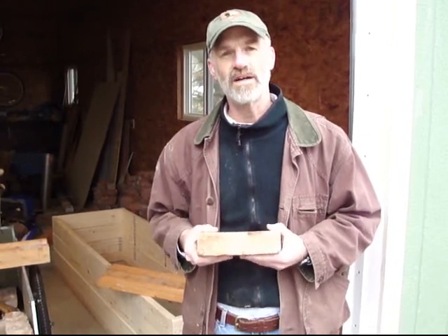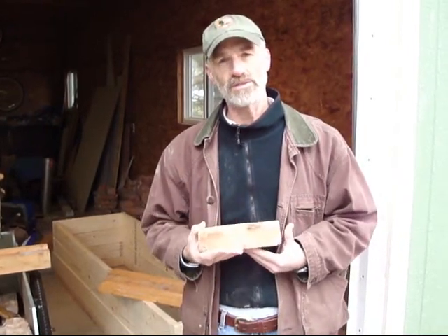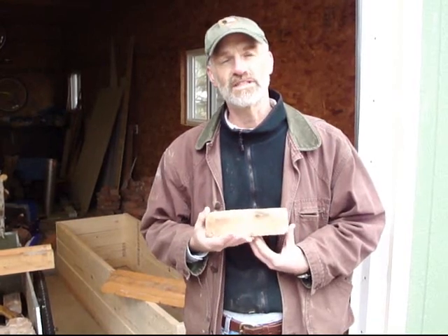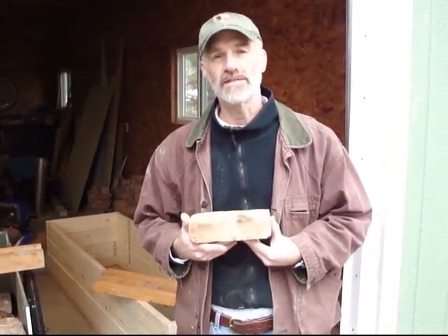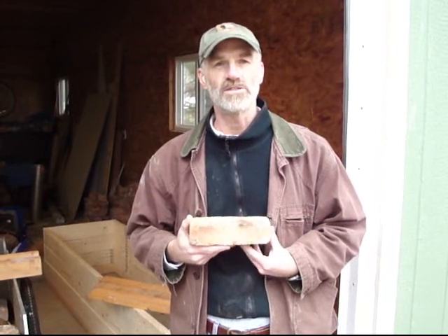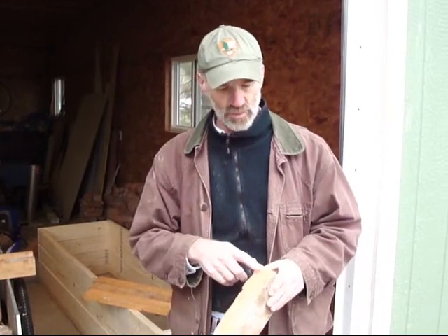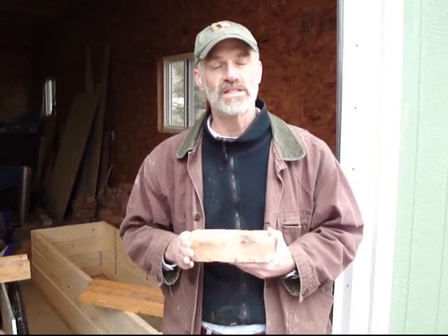Historically that was a source of many of the brick buildings in downtown Missoula. It's a soft brick — not a hard-fired or vitrified brick product. When used in downtown buildings it was for structure, and when used on the exterior it was meant to be painted. People who redevelop old buildings often clean the brick of all the paint and grime, thinking they're restoring it to its original condition. But this brick is soft and very porous, which means that when it gets wet and is subject to freeze and thaw, it spalls and breaks apart. Downtown buildings today that have this brick exposed as part of redevelopment will seal the brick with a clear seal to protect it from the elements.